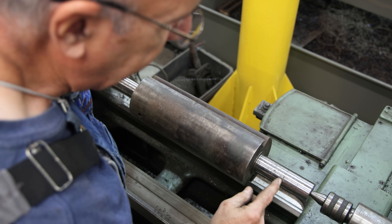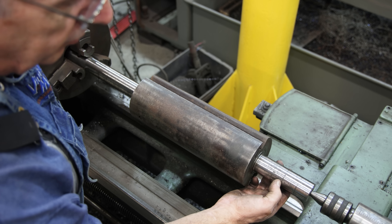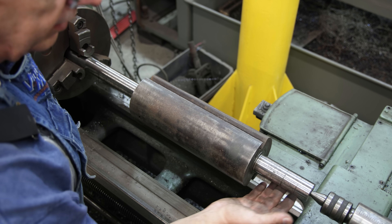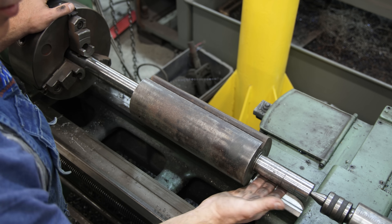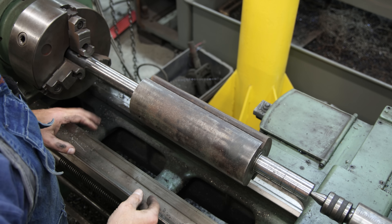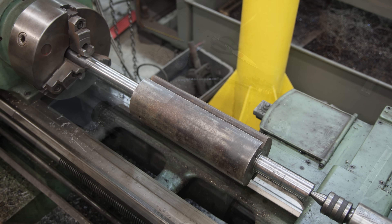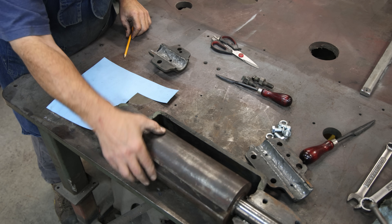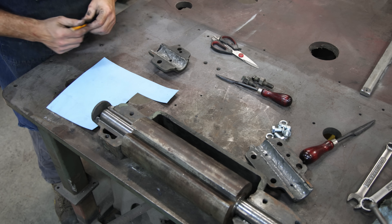We do have a few little grooves in here, but these are not very deep and that will be below the surface of the Babbitt — that'll just kind of serve as an oil groove. With Babbitt you really need to have about 80% contact, so we're going to be more than enough there. I put the cutter head in and this thing is running super smooth. I think that's just going to be just fine.